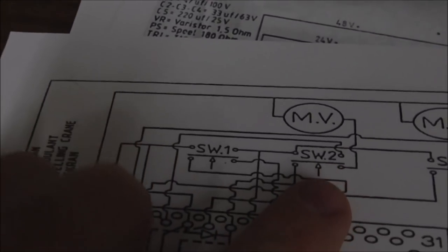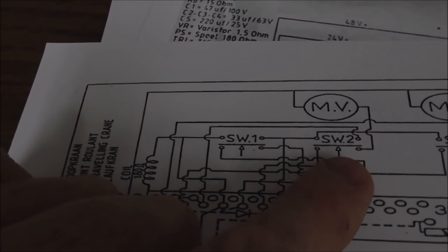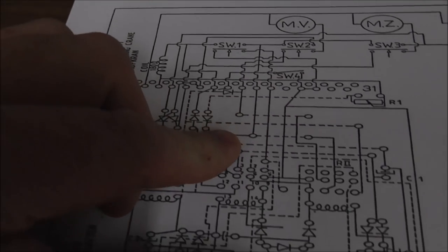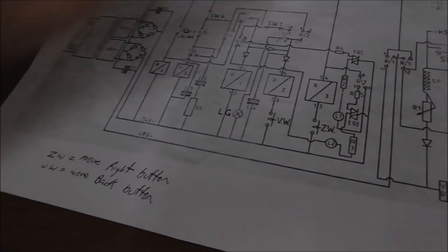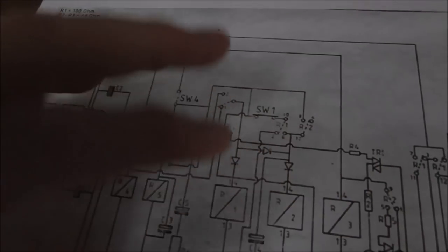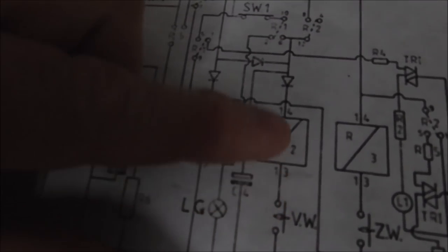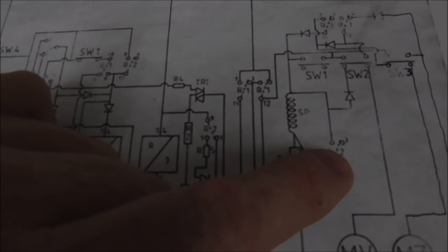And the reason for that would be because something must... Oh, yeah, it's because of the relay. We figured that out on this one. These schematics are better for one thing, and those are better for another. When you hit the button, R2 starts moving. It goes together, which starts the motor moving. Right here, this is the leaky diode we were talking about.